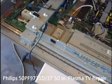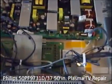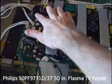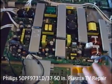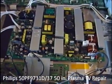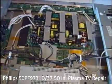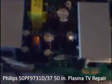You could plug it into the power supply and you could hear power going to the main board. You could see this green light here and this green light here coming on, and another one right up here. But after a bit these lights would go off and then the red light on the front of the TV would start flashing. After doing some research, I've narrowed it down to basically these two right here.